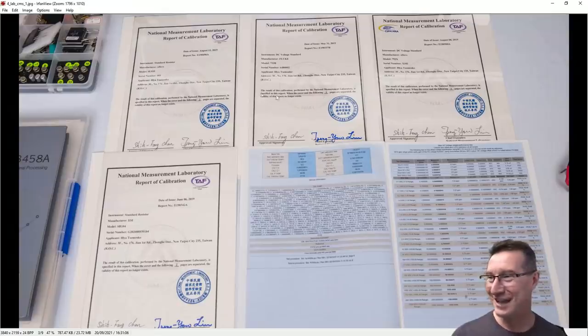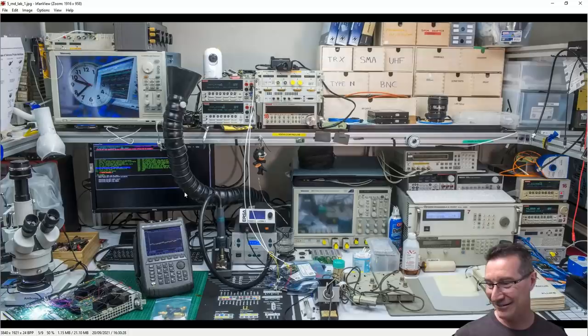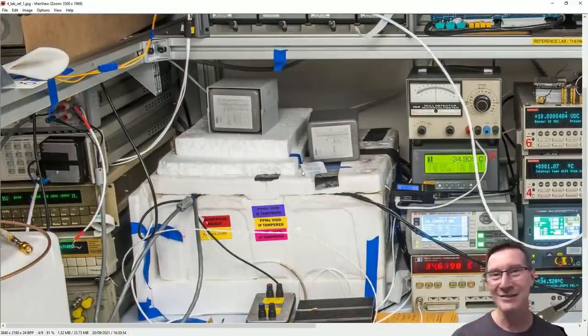And he's proudly showing off his calibration certificates. Look at this. A standard resistor, DC voltage standard, DC voltage standard, Xdevs 792. It's an SR104. And here's the references up here. They would be LTZ1000s, would they? Oh, incredible. Yeah, well, sampling with the 3458A, and I love the thermal chamber here. I love this. Probably has references in here just running for months and months and months. PPM's void if tampered. Calibration reject.